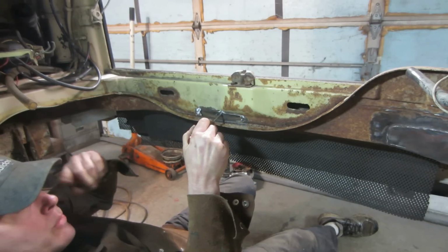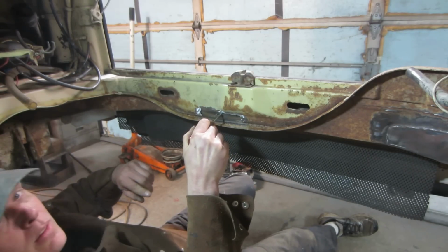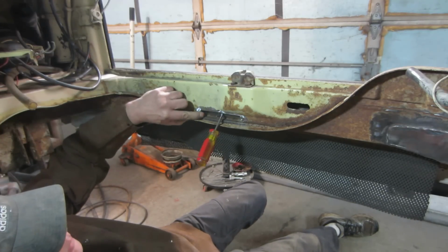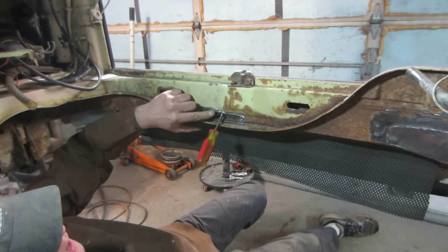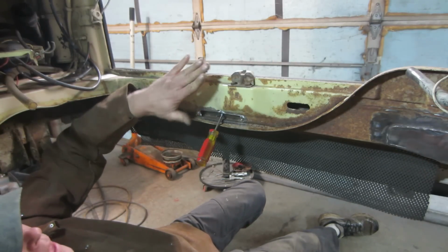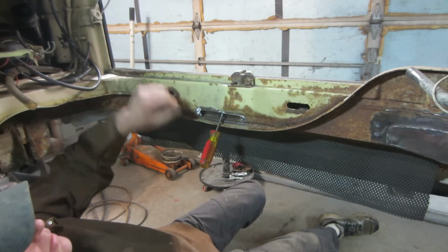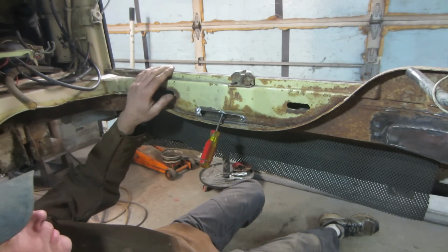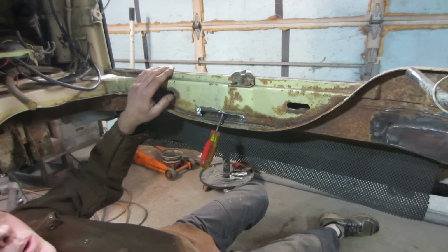This is good if you're doing an external panel that you gotta do fill over, if you're doing body work over it, because now the weld is recessed down inside a cavity. When you grind it, then you go to fill your mud over the top of that, it gives you some place to work instead of having to spread your Bondo all the way out to here to try to feather it back into the hole. So, showing it as an option.